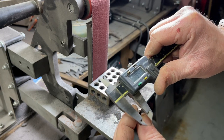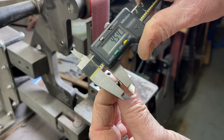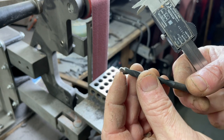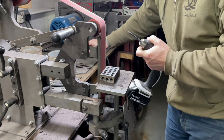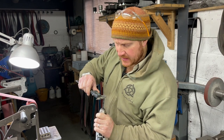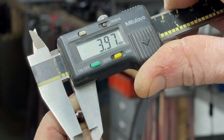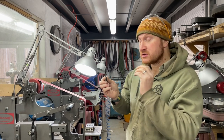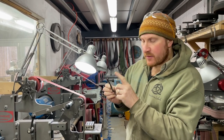Checking the diameter — at the moment we're at about 4.4 to 4.5mm, so better to be on that side of the mark. I'll put it back in the drill and take a little bit more off. We've taken our time, kept checking while grinding, and it's now about 3.99mm — that's pretty much as accurate as we want it. At this stage we've got the pilot at the right size for our bolt hole at 4mm, and the shoulders will create the sharp edges of the counter bore, though they won't have a cutting edge yet.